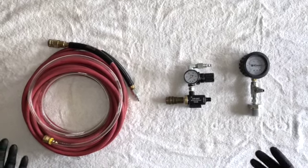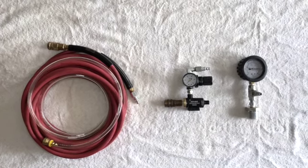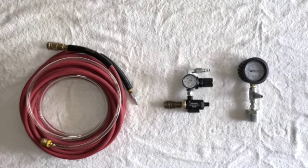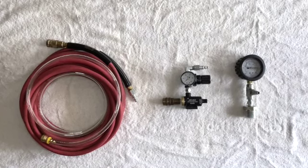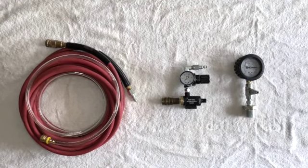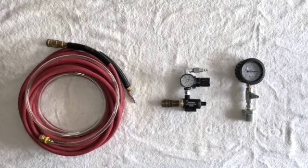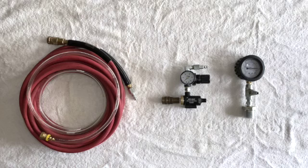Something that on bunchers in the past can really be a mess is the hydraulic hose for the final drives, because it's at the bottom of the machine and they're number 16s or number 20s, and it's a long hose. It's kind of a booger to get to and get out. And because it's at the bottom of the machine, you have the potential for losing a lot of oil. One of the downsides is oftentimes if you lose them and it's a serious failure, you're often at the bottom of the hill. So these won't be all that handy at that point if the service truck is at the top of the hill.